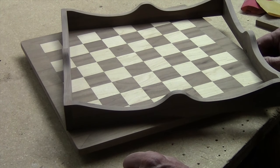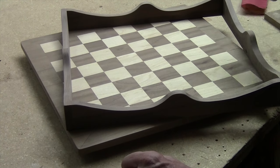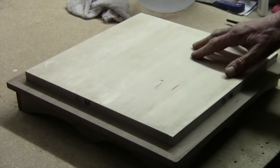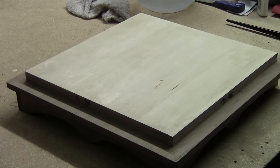It's looking good. Our next step is we're going to have to lightly wet everything. Let it dry. Then we got to go over the whole entire surface again with a 400. Okay, remember I lightly wet all the wood and I already sanded it to a 400. So the next step is to glue the top to the legs.